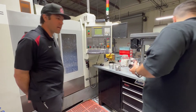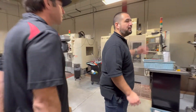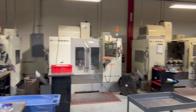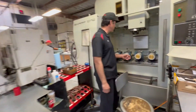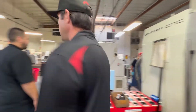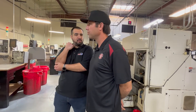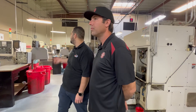This machine is doing the sides — milling the pin boss. These machines are all profiling the piston, sizing the piston. They get put inside pneumatic vices that hold the pistons. These are specific piston-design machines. Then they'll come here to pin bore — not pin hone, but pin bore — to get it closer to where we need it to be.